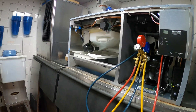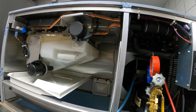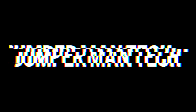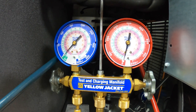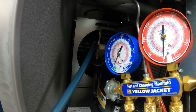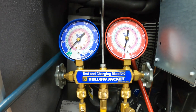Hello everyone and welcome to Jumper Man Tech, where we specialize in HVAC but do everything DIY. Today we are back at this Hoshizaki ice machine that we just installed, which came with no refrigerant in it. In my previous video we installed this unit, turned it on, it went into error, and we found out there was no refrigerant in it. We found a leak at the compressor connection — a poor connection that came from the factory — and I'll show you guys a picture.